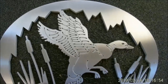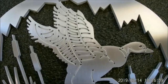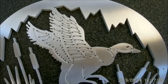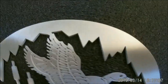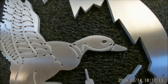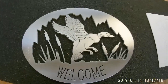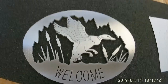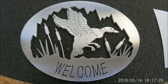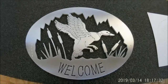The good thing about using the etch instead of the cut — if you imagine having all of these as actual cuts going all the way through the material, a lot of things will just basically cut itself apart. If you look at this little line across its beak, if that was a cut, it would have cut the beak off completely. So it works great on artwork, and you can also use that low pressure etching for part numbers and putting names on things for industrial applications too. Works really well. Thanks for watching.